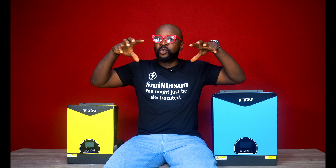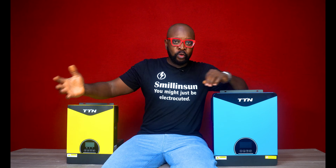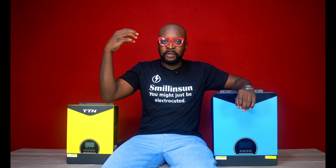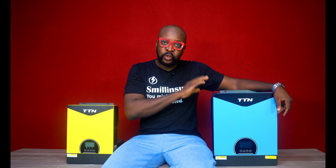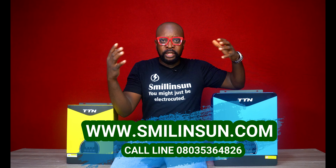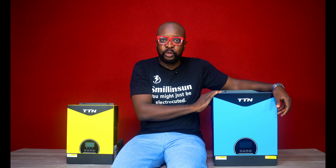When you're introducing more solar panels, at some point the capacity of the solar panels might be a lot higher than the capacity that your hybrid inverter can handle. At that point, you're permitted to get an external charge controller. But if your solar panels are within the range of the capacity of this hybrid inverter, then you're good — you don't need an external charge controller.